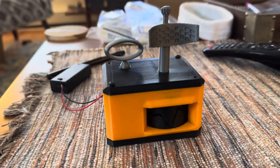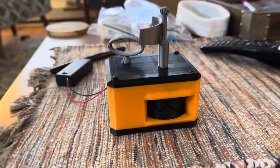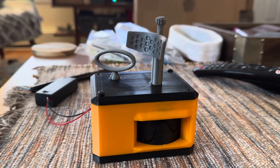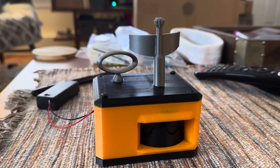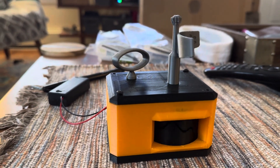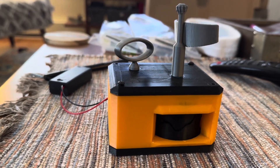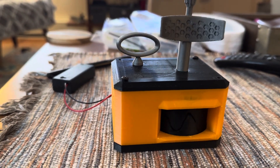Now here's the action — I'm going to turn the battery on. The lights aren't here yet, so this is just the motor action. Inside is a step-down motor. It's a fast motor, but it's got a gearbox attached to it which steps it down to exactly the rotation — a little bit faster than what you're seeing there. The motor is situated just to the left of the barrel, and it's got a gear on top, and that gear rotates a gear on the barrel, which is more or less the exact same diameter as the barrel, so that slows the barrel down a bit.